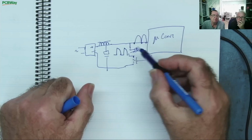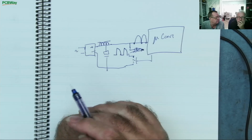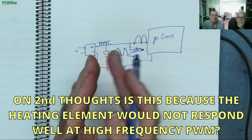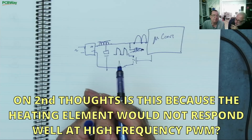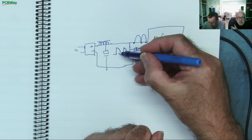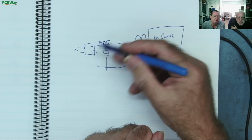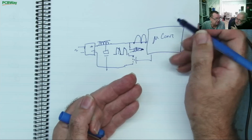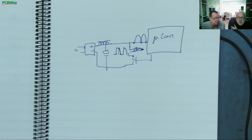Yeah. The microcontroller is just effectively measuring it, it knows the 0 crossing point is here. And by setting a certain amount of delay before it switches that on. Yeah, this is simply to save on components. Save on components, and obviously the longer it delays, the narrower this will be, so the lower power in the soldering iron. And he's measuring the temperature of the soldering iron with a thermistor, and then he's moving that point. That circuit is called a chopper.